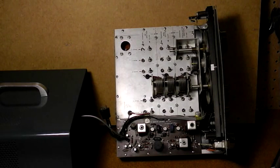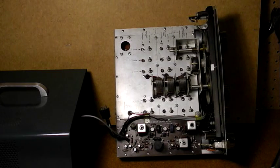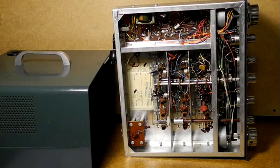Let's take a look at the insides. The circuit uses ten transistors and six diodes and is a single conversion superhet with a 455 kHz IF frequency. It uses fixed pre-aligned ceramic IF transformer filters. The sensitivity is rated at ten microvolts on the AM broadcast band and two microvolts on shortwave. It uses a mixture of printed circuit boards and point-to-point wiring. You can see the alignment coils and trimmer caps. The alignment procedure is quite lengthy — you need to adjust thirty caps and coils for a total of five bands. Getting the dial calibration correct is an iterative process, and you also have to watch out for image frequencies due to the low IF. Owners who experienced poor sensitivity or dial calibration likely didn't properly align the receiver. An RF signal generator is needed to align it.